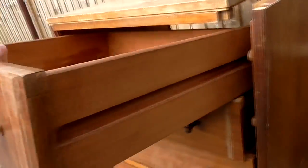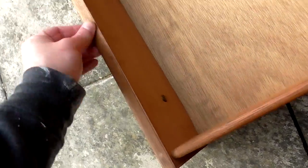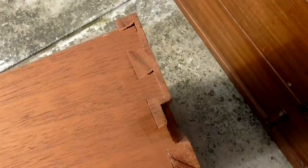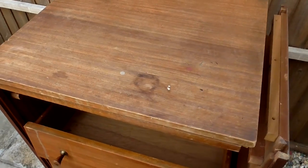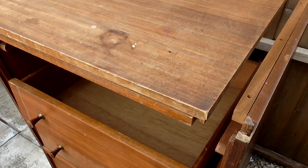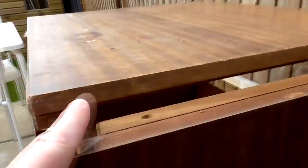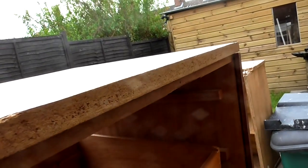The drawers are really well made. They're very solid — they're built from sapele sides and a sapele front which is probably a veneer over chipboard or plywood. They're built with dovetail joints, with a piece of plywood on the bottom screwed in at the back. Inside, the drawer runners are solid sapele. The top is also a sapele veneer over either plywood or particle board, as there's side grain along the front and along the edges. In fact the veneer has peeled off the back and it is indeed particle board.